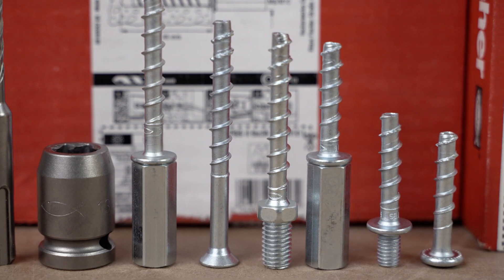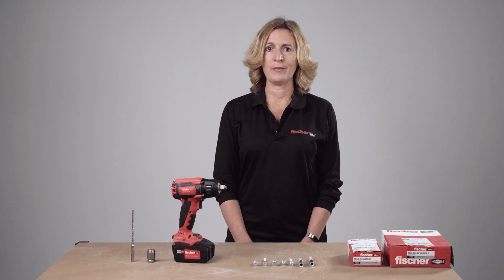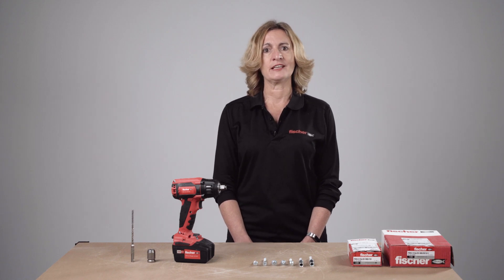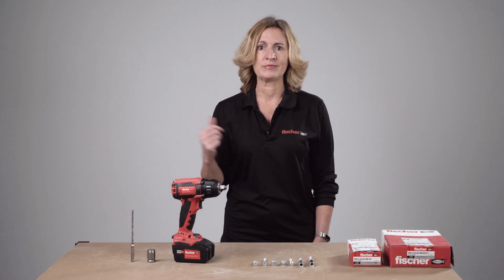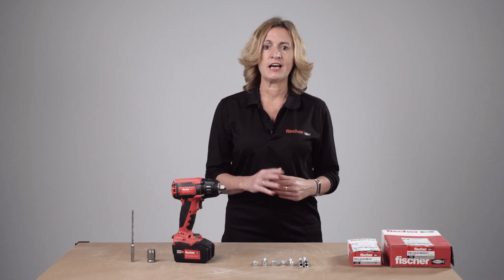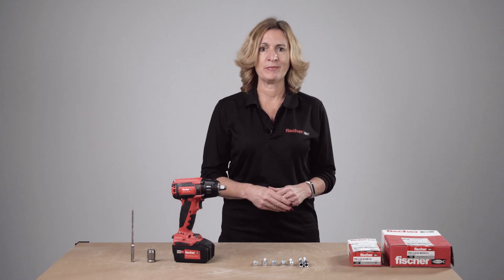In addition to concrete, it can be used in solid, dense masonry. Thanks to a small hole diameter and shallow embedment depths, FBS6 concrete screws are perfect for applications where reduced drilling is required, for example when fixing into densely reinforced concrete. Concrete screws are also ideal for projects requiring fast and simple installation, thanks to their efficient setting process. FBS6 can also be fully removed, adjusted up to 20 mm, and is a very popular choice for MEP applications.